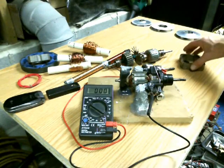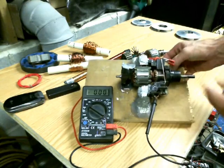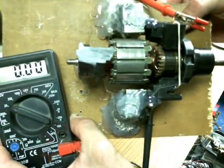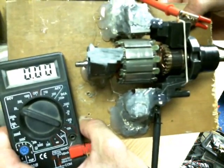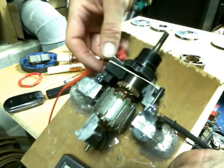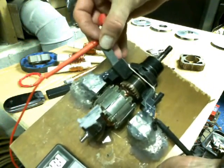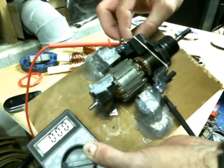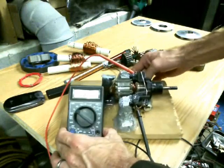What I did was I took a couple of magnets and hot-glued them on there. You can see I've got a really large gap in between the magnets. They're not gapped very well because when you're using hot glue it's a real pain in the neck to get them close enough without them sucking to the armature. I kind of threw this together in a real hurry. But you have the brush mounts that came in the electric motor — let me pull one of these brushes out. These are little carbon brushes and that's what actually transfers electricity from point A to point B. I've got a little rubber band holding these in there and those brushes ride right around on the armature.